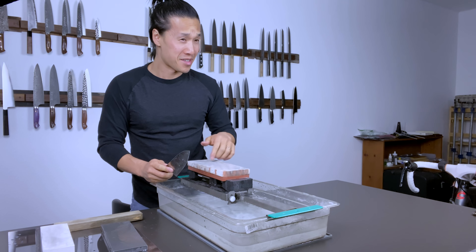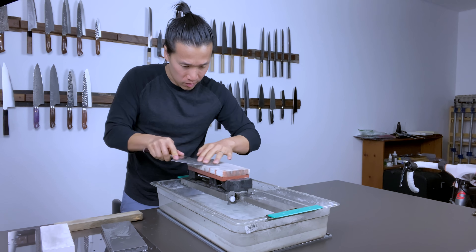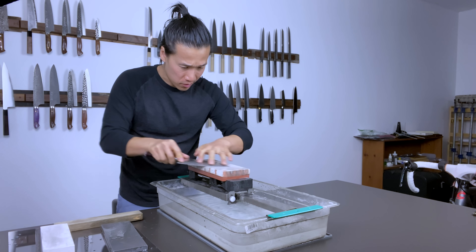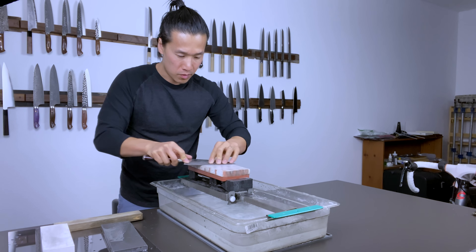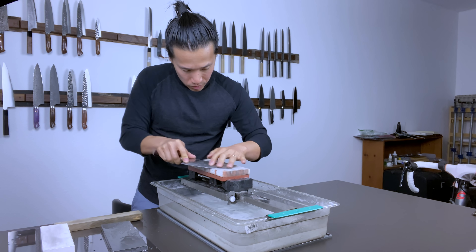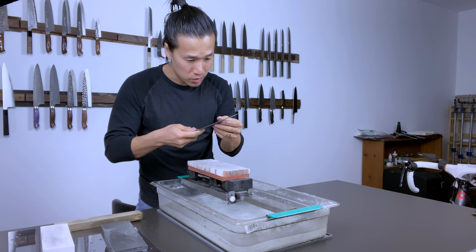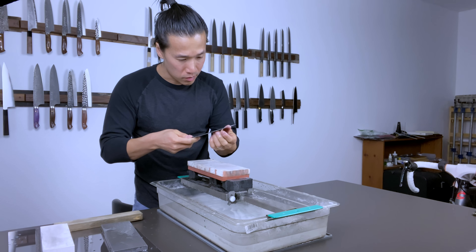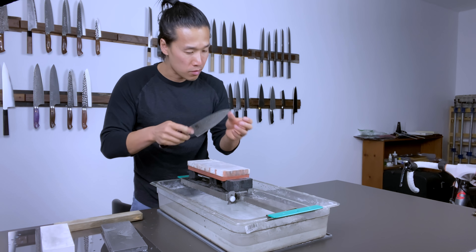I have spoken to working chefs — subscribers who have used the same knives for 30-plus years and have never thinned their knives at all. Thinning your knife requires a lot of work. If you've never done it, yes, it will scare you and it can ruin your blade if done incorrectly — not destroy the knife, but ruin the aesthetics and the primary bevel. I have thinned knives in the past during repairs when chips are three or four millimeters deep, and even then those knives stay relatively thin.